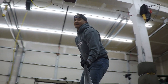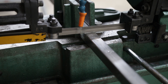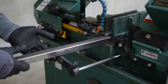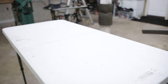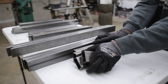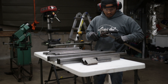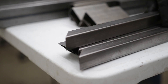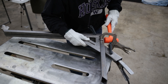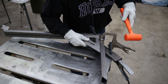Having a plan laid out took out all the guesswork. I measured and marked, then used my metal bandsaw to cut the tubes. I had a chop saw laying around, but I actually wanted to use my metal bandsaw because I didn't want sparks flying all over the place. It's slower, but I wasn't in a rush. After I got all my pieces cut, I deburred them with the flat disc on my grinder. I started out with the base rack because I wanted a good foundation for the remaining racks to build off, and I spent a great amount of time getting everything squared away.